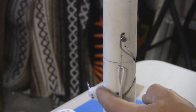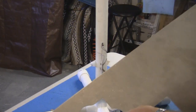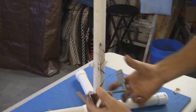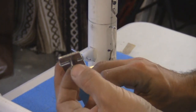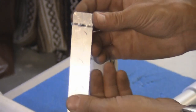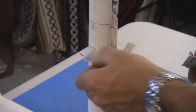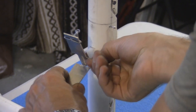There is an attachment you can put on to give it more leverage and pull the pin out that way. I glued this little arm on right here and created this little aluminum thing. I took a piece of aluminum from an industrial supply metal store, traced out a pattern, used my jigsaw and cut it out. I just took a piece of my wife's cutting board, cut a piece out of it, filed it down, drilled a hole in it and epoxy glued it onto this thing. Then you can just put this pin on like this.